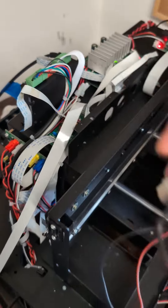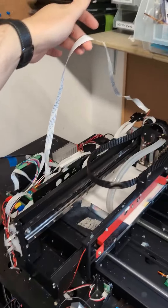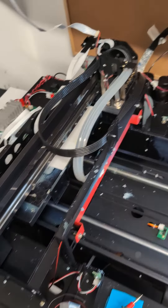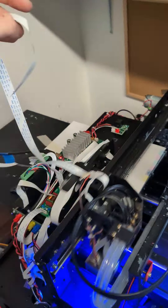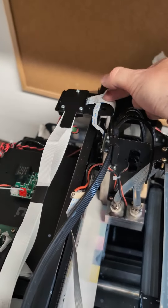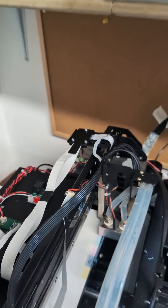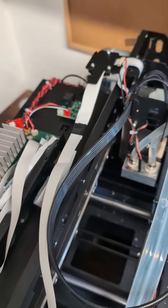So we have new power rails, new light, and new ribbon, and we've measured voltage right at this point. The print is about to start — and there we go, super bright LED. Next up, let's use this new ribbon on the original LED. I'll just hold this in the air since it goes left and right and I don't want to install it yet — and there we go, the LED is lit. So the culprit after all that is not the LED and not the power rails — it's literally just the ribbon that's damaged. Once I've removed the old ribbon you can clearly see exactly where the break is. It must have got caught and kinked while moving back and forth, and just basically fractured.